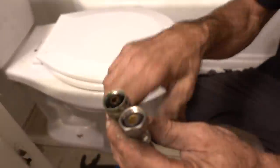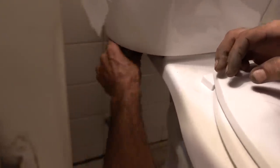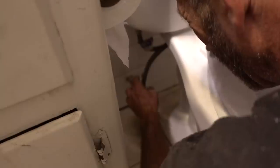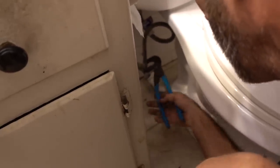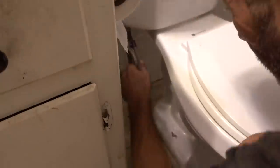These are half inch right here and this is like your water hose — same as the water hose out front. I've gone to a house before where the water in the wall wasn't working, so they took the water hose from the front yard and rolled it through and put it to the toilet. Put that behind there so we don't have to look at the ugly hose. Now, this is probably the only one I'll use a wrench on — this guy down here. The top part I only tighten with my hand. I'll go ahead and crack it open and see if I got any leaks. I can hear it filling.